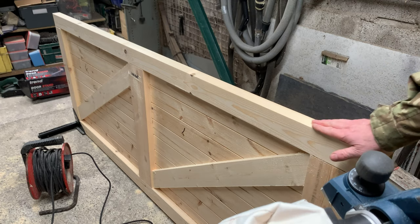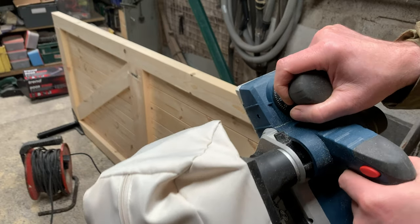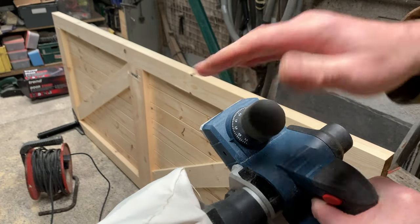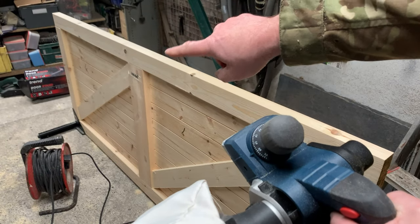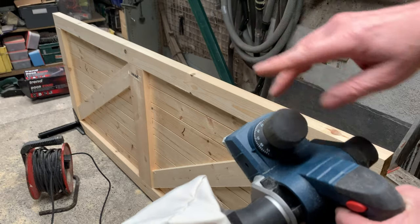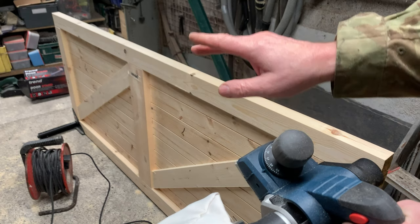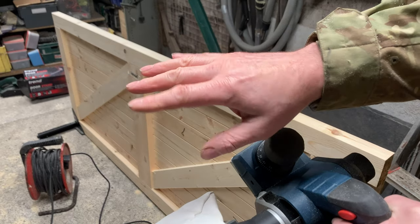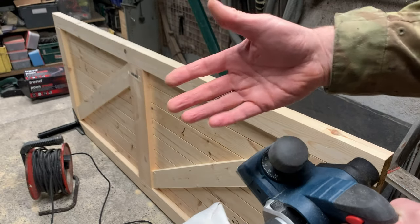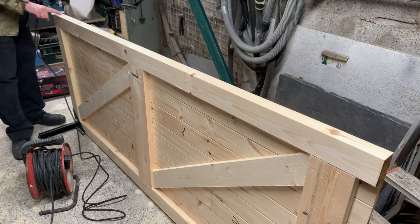That's a beautiful finish on that. I'm going to come back the other way — something I've always done. If the blade isn't quite aligned and is taking slightly more off one side than the other, going back down the same direction compounds that error and the door ends up more sloped. If I come back the other way the error won't necessarily be corrected, but it'll be better. So that's a technique I always use. We'll do another 2mm pass and then we can bevel.